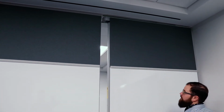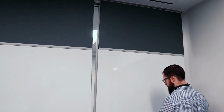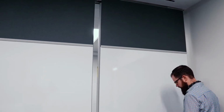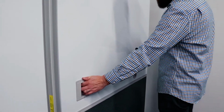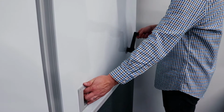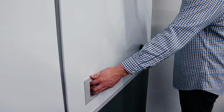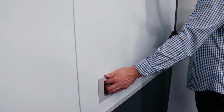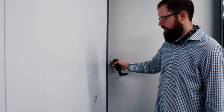So with this panel, we're just going to get the top seal close to the panel in front of it, and we're going to start cranking this top hole while holding this handle right here to keep the panel aligned. And as you're cranking the expander nose, it'll bring this panel tight. Once the expander nose is fully engaged, we'll deploy the bottom seal with this bottom hole.